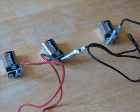Now in this next photo, you're looking at the batteries connected together in what physicists or engineers call a series. What a series is, you hook up the negative and the positive side of each battery to each other, and what you get is a cumulative effect of each amount of voltage that the battery has. So in this case we have 3 batteries connected by the wires and alligator clips I'm using, and we hit a total direct current voltage of 27 volts, and that's what you need to help produce the silver.